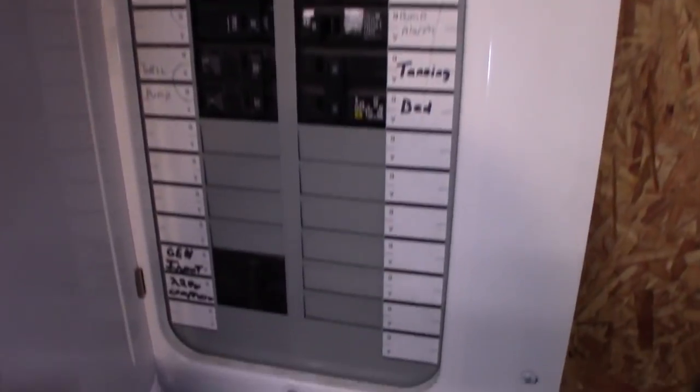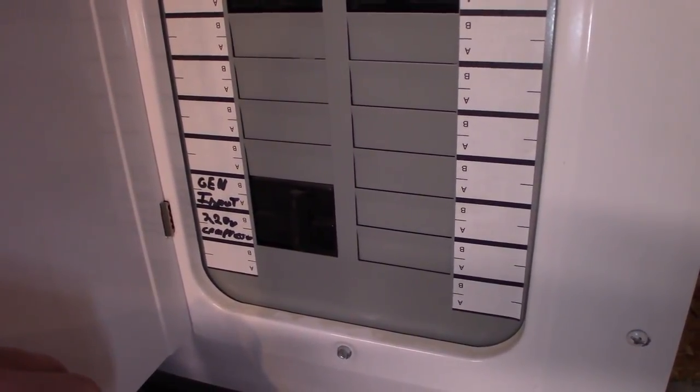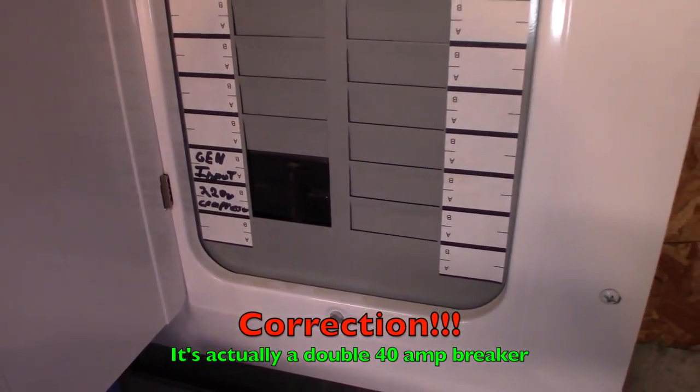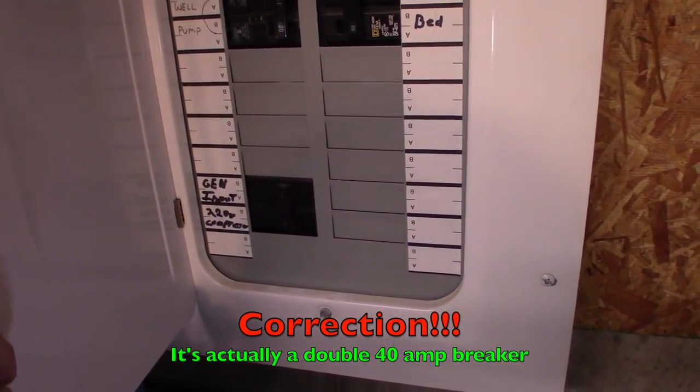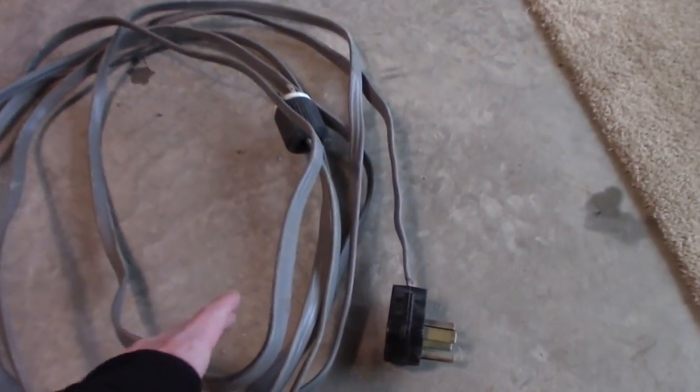Here's my electrical panel — very standard. Down here I've added a breaker, which is a 220, but it's basically set up as a generator input or a 220 volt air compressor output. This is an 80 amp breaker, which is pretty important if you're running multiple appliances — you've got to make sure you get a very hefty breaker. At the other end of that circuit is this plug right here, a standard 220 volt outlet. They use these for electric dryers that run on 220 volts, but it's a very heavy gauge outdoor 220 volt wire. You probably already have one in your house. Chances are the breaker isn't that big though, and the wiring may not take the amperage that's going to be drawn through to power the entire house. This right here is the reason I consider this procedure to be so dangerous.